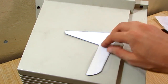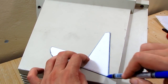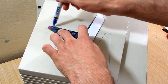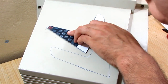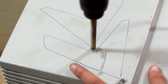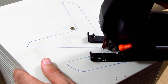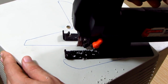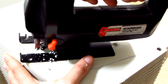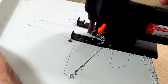I made the legs template out of cardboard. With a fine tip marker I drew the outline of the legs. I made a PDF for you if you like this exact shape. I drew the holes for the jigsaw blade with a 7mm drill bit. I chose a steel cutting blade to make cleaner cuts, but the plastic was melting as it got hot — luckily some drops of oil fixed the problem.